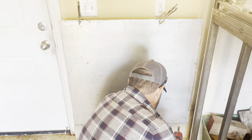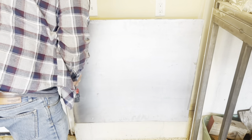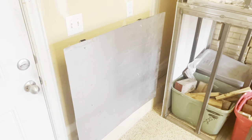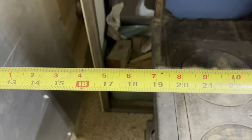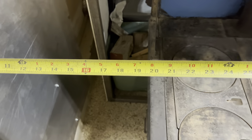This allows your clearances to be reduced by half. In the case of this old cook stove, because there is no clearance listed, the default clearance is 36 inches and we are cutting that clearance in half to 18 inches required. I've got about 19 inches, so I'm more than safe — and I really don't want this old cook stove burning my house down. Better safe than sorry.